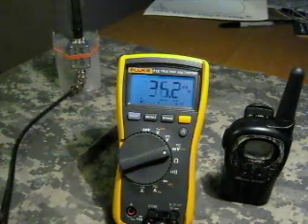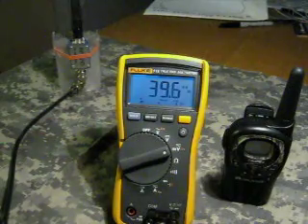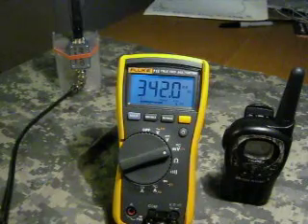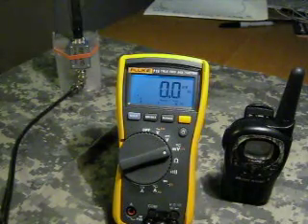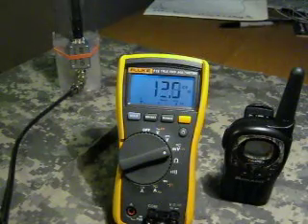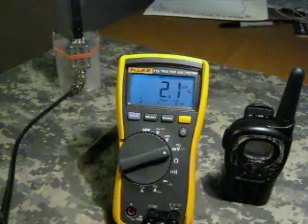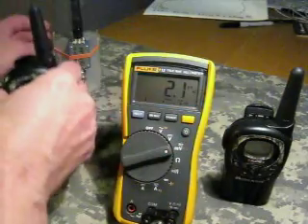I tilt the thing — look at that. I tilt the radio at a 45-degree angle and we went from 350 millivolts down to about 35. Standard radio up again, back to 350. And look at that — I'm still transmitting and I'm down to 4 millivolts. From 350 millivolts down to 4. That's basically what happens.